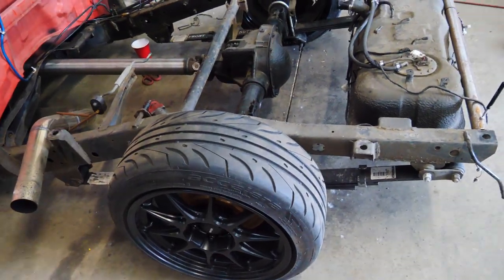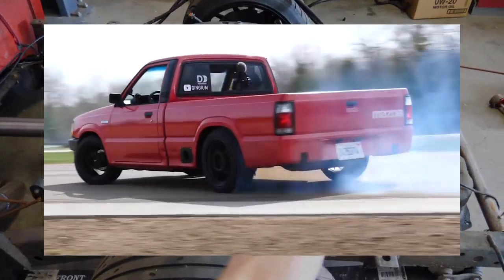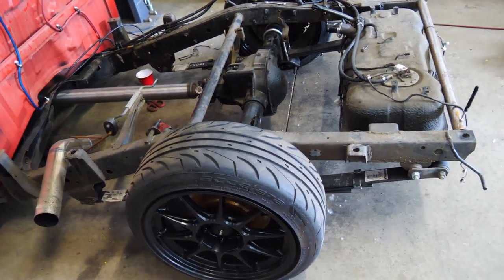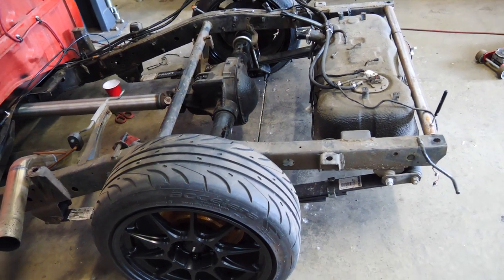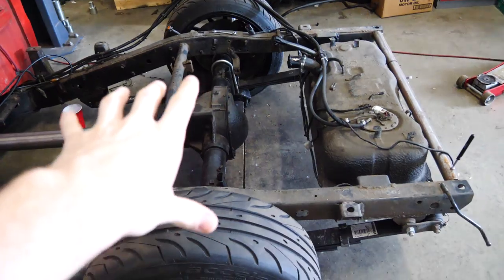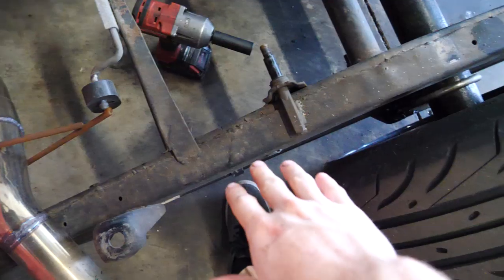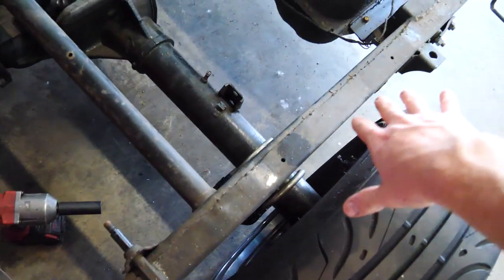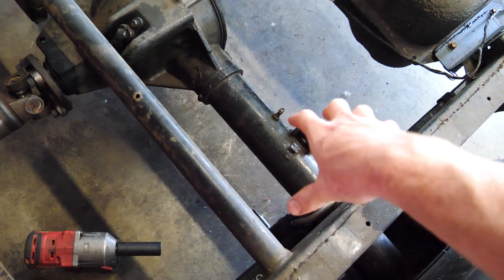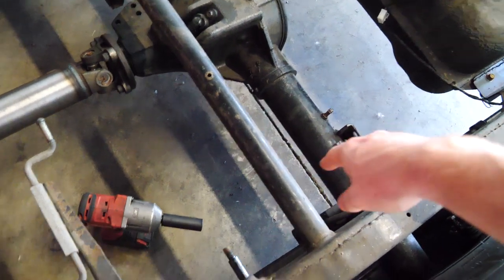That's why when drifting, it gets wheel hop, because the axle pulls forward and back and forward and back, and it causes everything to shake, and it's really terrible. Leaf springs are great, they're cheap, they're really good for cheap off-roading or just a street car, but for track driving, what a four-link does, instead of having this flexible bar that connects the axle, there are solid bars, one on top and one on bottom on each side, that connect the axle to the frame.